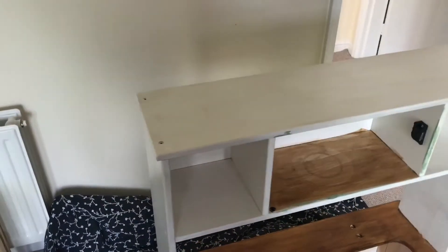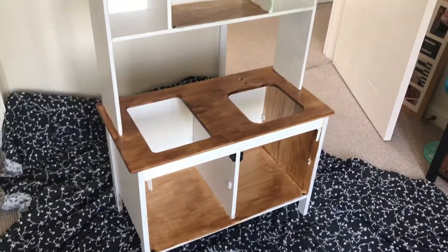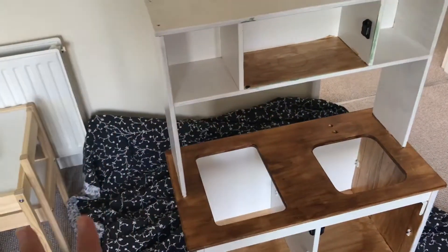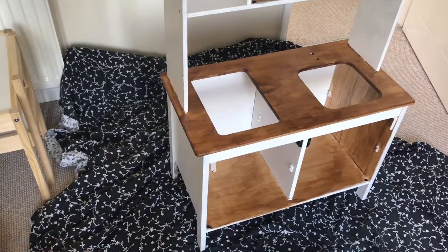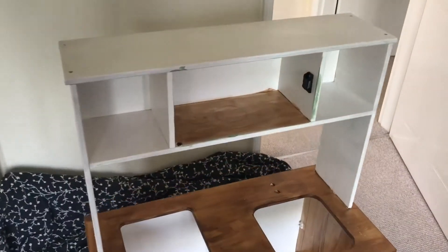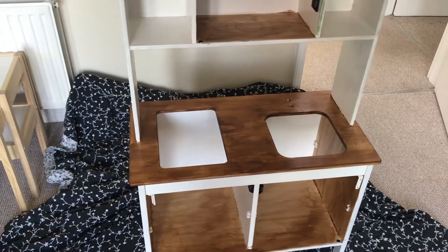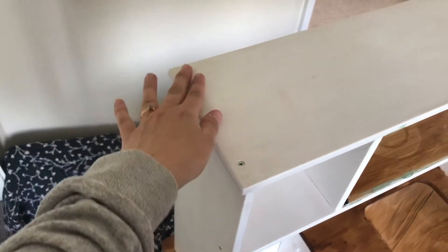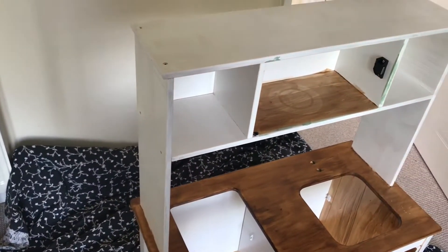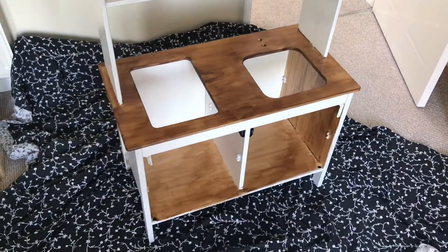Hi guys, so it's been a few days since I finished the start of this kitchen makeover. All I did was prime the surfaces here - I'm not going to get too close because it is a really bad job. All the white bits I've primed in white and then I've stained the insides and the top layer of wood. I've also painted the cupboard doors. Today I need to finish it off, so the first thing I'm going to do is give all of this the right coat of paint because this is just the primer. IKEA furniture can be hard to paint because the material is shiny, so I was advised to prime it first.